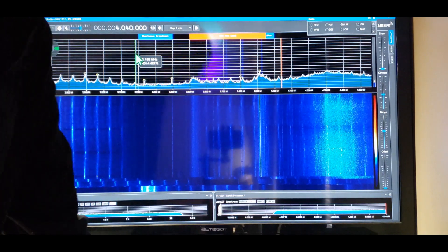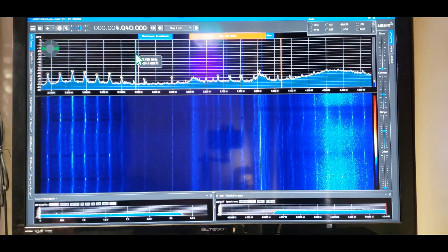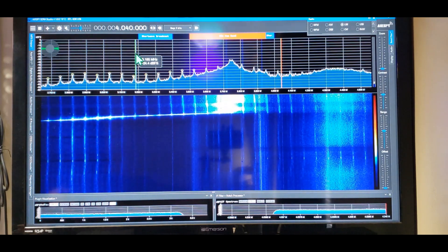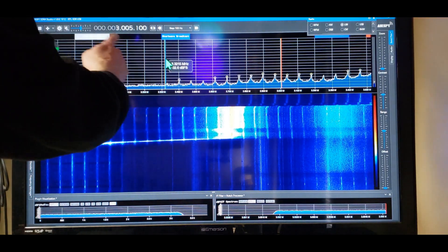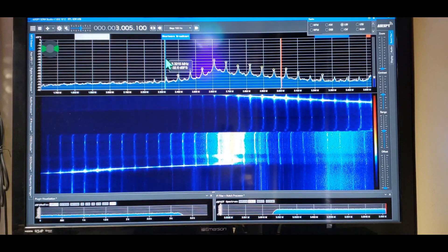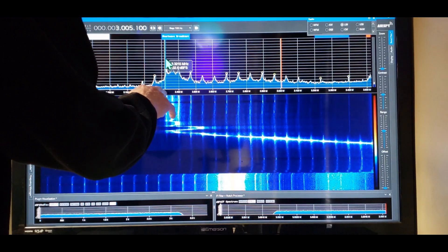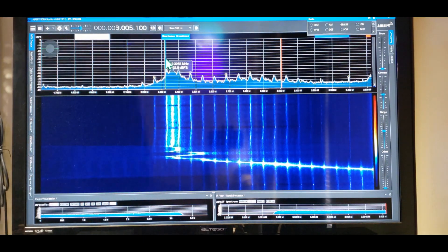You've got to run a lot of chokes to deal with apartment noise. Let's bring the capacitor back down to 80 meters. Let's find out if it comes back to 160. Bringing the capacitor down... yep, right there it stops. So we pick up right at just over 2 MHz and go all the way up. The range we found goes from about 2 MHz up to 6 MHz at the low end.